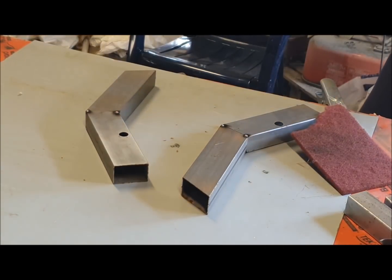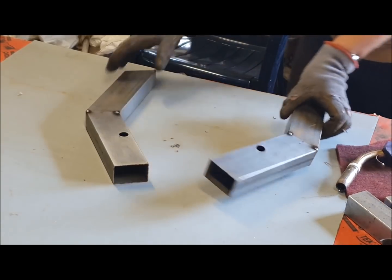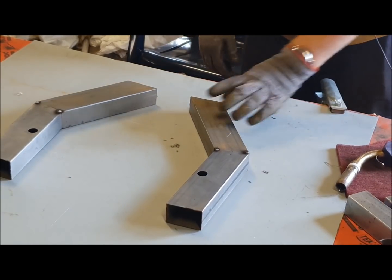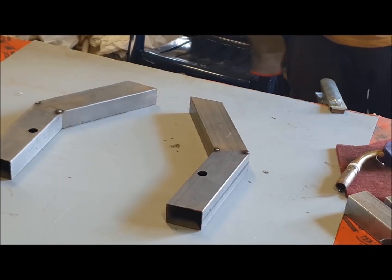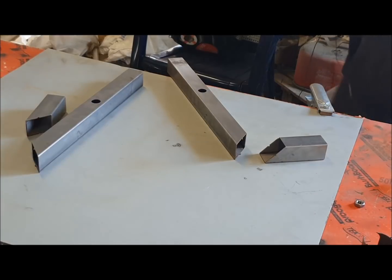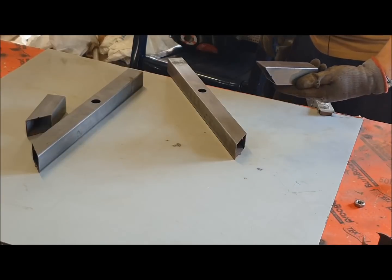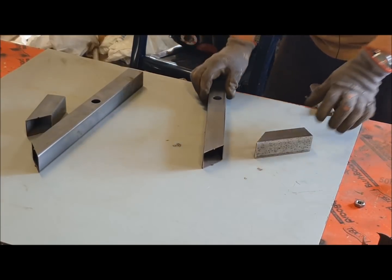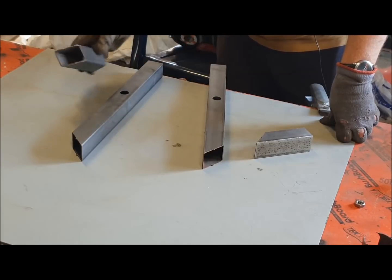Just tack on each of the four corners so that they're reasonably strong. The next part to make is the lower part of the rear — these are all tube numbers T1009, T1010, and this is T1010L and another T1009.